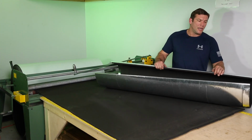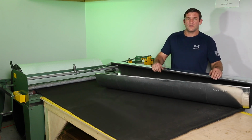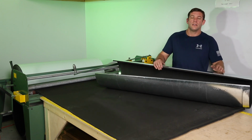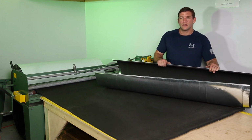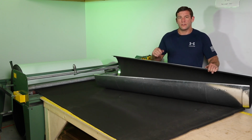It's done for. And it's critical that you get it right, because when you're internally lining, once you snap this stuff together and you hook up your duct system, you can't tell if you have a defect. It just lives there, it exists. That's another reason I don't like this material outside of conditioned space unless I've got it externally lined. If I did this externally lined, I can confirm that all my seams are together tight and all that good stuff. Now, we use a process and we're real careful, and I'm pretty confident that most of this stuff is going together right. I'm just saying that if it didn't go together just perfectly, since we're in conditioned space, the issues coming from that wouldn't be that bad.